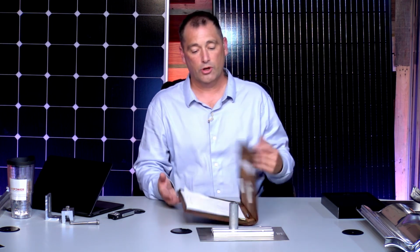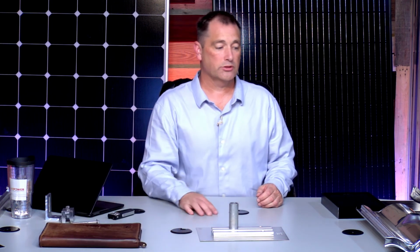That's the most expensive, most laborious part of an installation. So when you are looking to get a solar install done, if you have a tile roof, expect that to be the most expensive installation. And if somebody's not charging you roughly 15 to 20 cents a watt extra, you're likely not getting a good install. I've seen many people take many shortcuts on these. There's all kinds of ways of doing it. It's a very expensive, time-consuming process. It really is. So people should be adding to cover that cost.